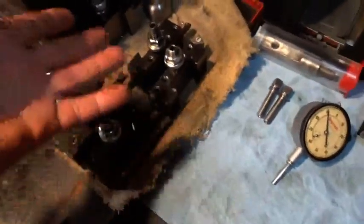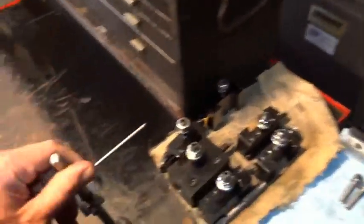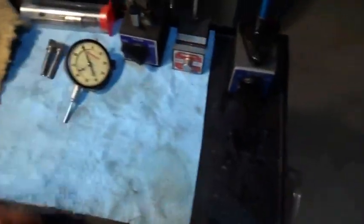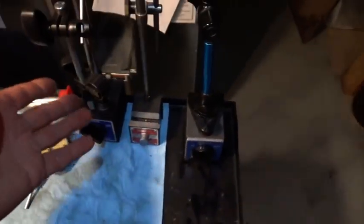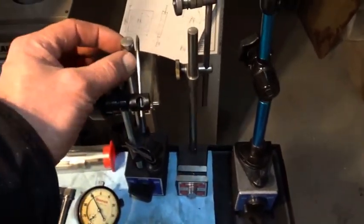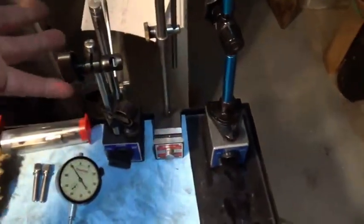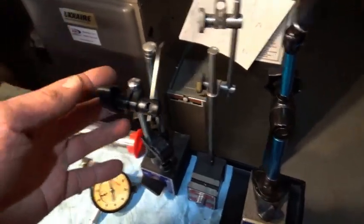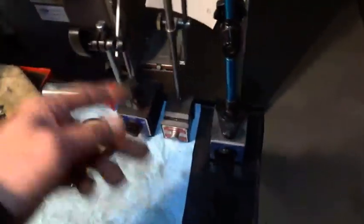On the top I have my tool holders. This is kind of a homemade scriber, but it's set to lathe center height so I use it to set my lathe tools. The damaged Starrett indicator — you've seen that. A Fowler indicator stand, but the rods are bigger than everything else so only those snugs work with those. I just have a scriber tip in it; I use this for rough indicating when I'm using a four-jaw chuck, or as a sort of height gauge. And a Starrett indicator stand.